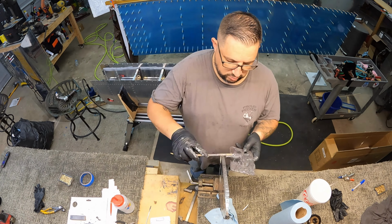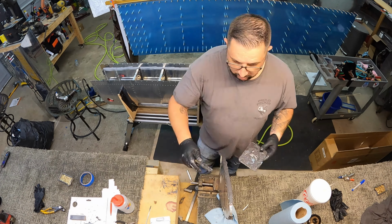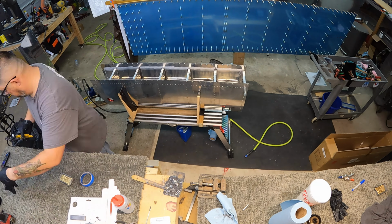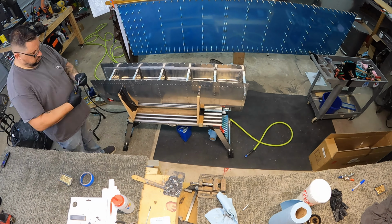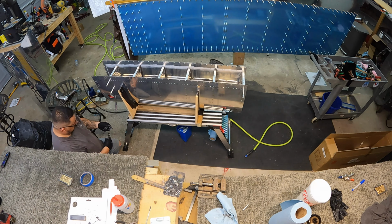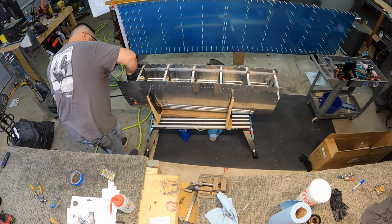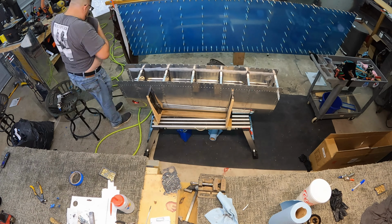I don't know if I'll have enough sealant to make it all the way through or not. I think I will, especially since I have the 2 cartridges for the Semco gun. That is going to be my preferred method for putting the rear baffle in. I hope 1 cartridge per baffle will be enough, but we'll find out. So, same as all the others, get it pushed into place, seated really well, and then clecoed, riveted, and here you see me going through and finishing it off through the magic of editing.